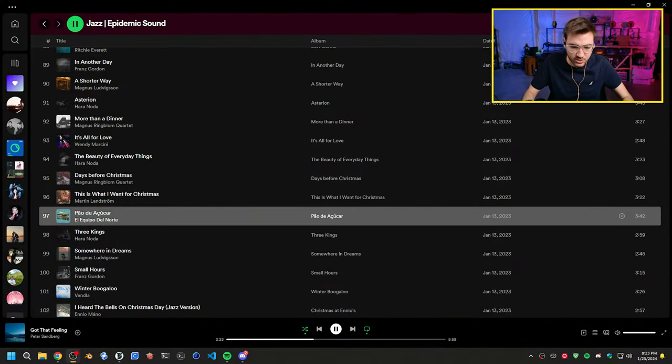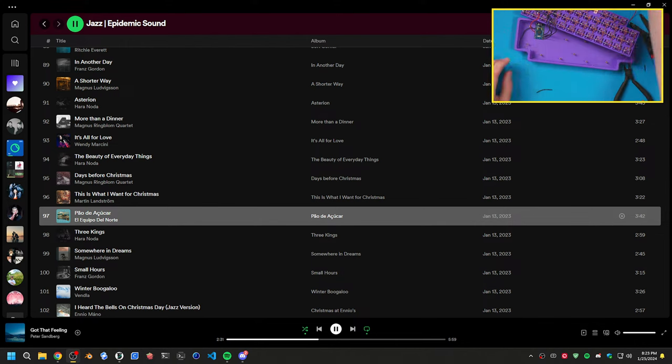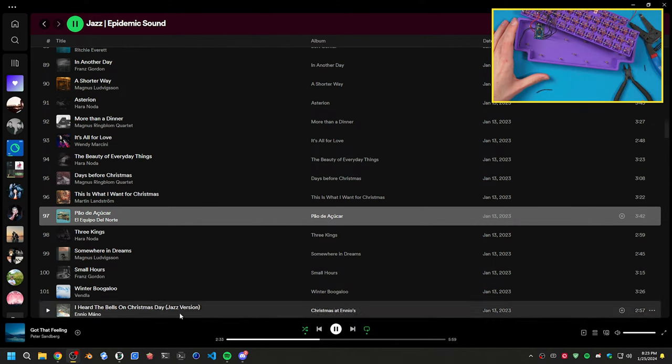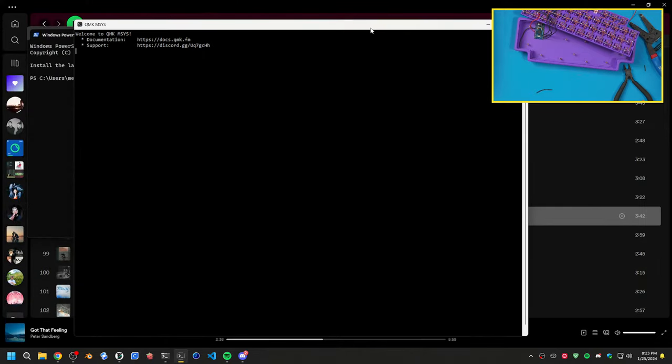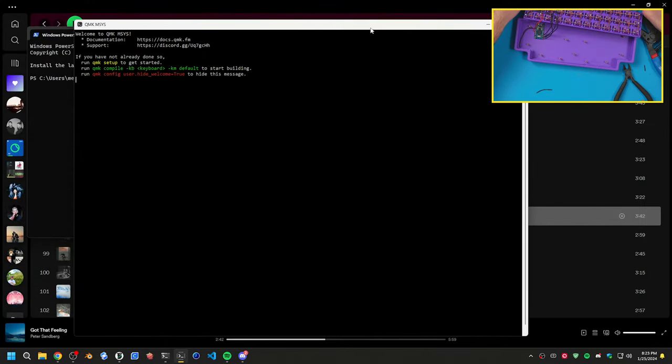That is holding in there, so that's good. But I do need to leave this open so I can actually reset it. So let me just pull this out a little bit. All right. So I can actually show you the overhead so you can still see that. We're going to go to QMK. And we're just going to flash this with the default key map, which should work for the ScottoAlp. So I want to go to QMK flash, Handwired, Scotto Keybs, Scotto Alp, KM default.